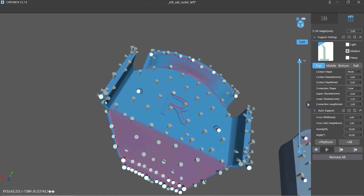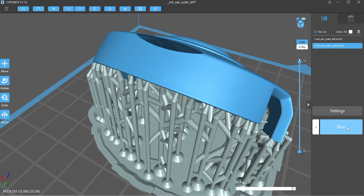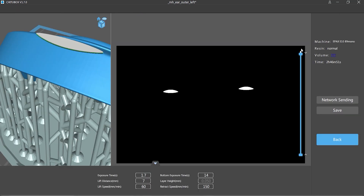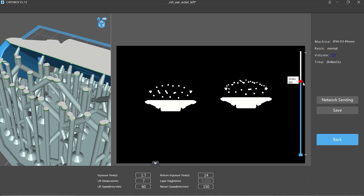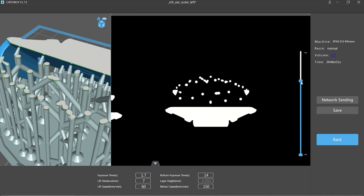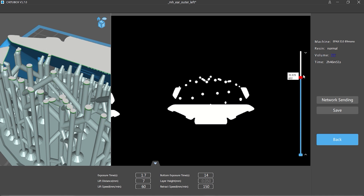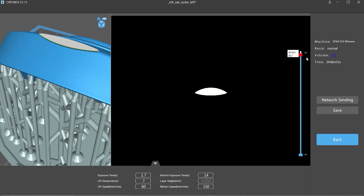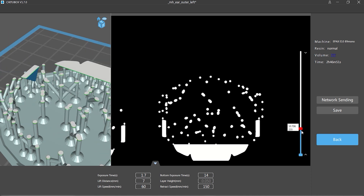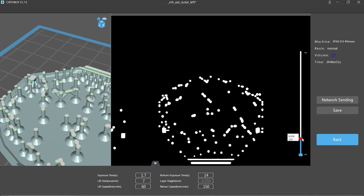Where you see the areas that are pinkish and then red, those are areas at shallow angles in comparison to the surface of the build plate. The more shallow the angle, the higher the pull forces on the FEP sheet when each of the layers are rising up, so you need to pay extra attention to those areas. You don't necessarily see the red areas on sharp corners, so you need to manually look at the preview and see where those sharp corners are first being built and make sure you've got enough supports to deal with each of those islands.